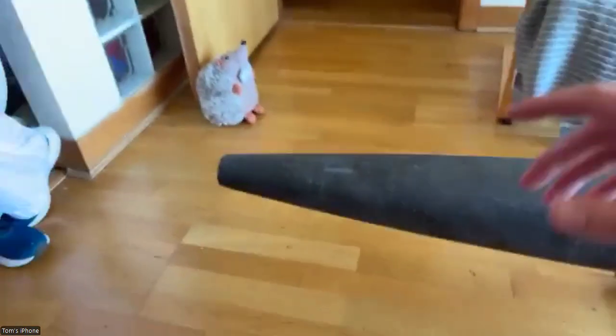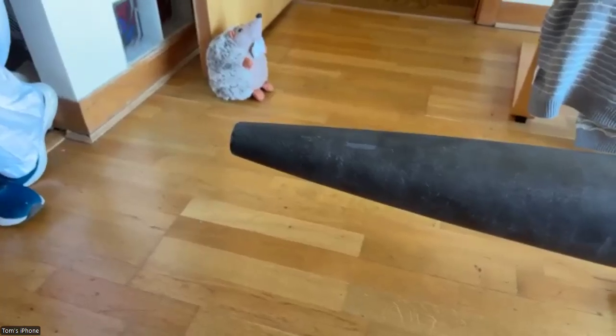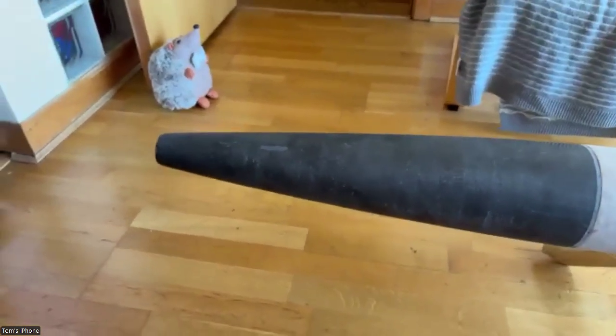So the nose cone tip here, there'll be a threaded rod running down the length of the nose cone with the bulkhead to hold it secure. The tip we made of aluminium, it's 125 mil long, and so that'll act as a heat sink to hopefully stop any overheating of the nose cone itself.